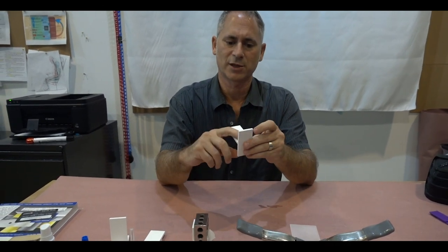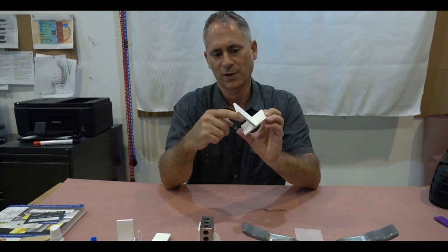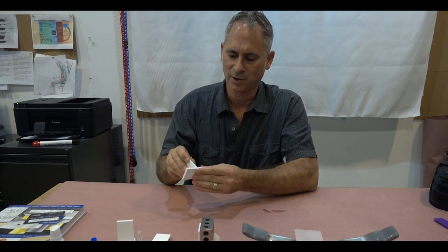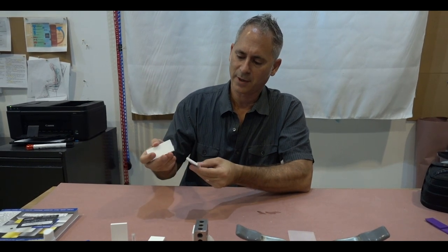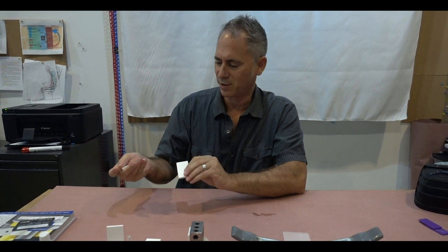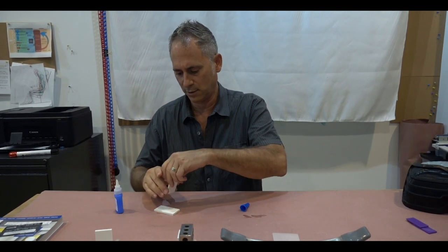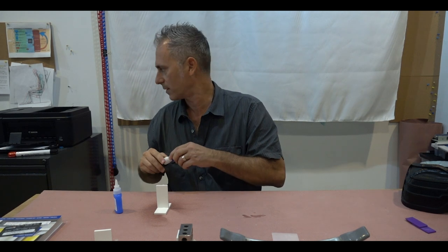This piece had just plain super glue and a little bit of activator. The nice thing is it was nice and clean. The negative is we have a butt joint with no extra mechanical bond. I'm going to try to break this — it actually broke, but the bottom didn't catalyze very well; I think the accelerator didn't get under there. It also had some paper on the top that prevented a good seal. Let me repeat this test properly — I'll apply it now with the accelerator and it should be fine in about five minutes.